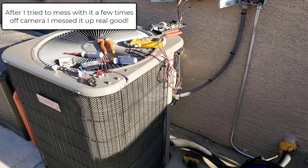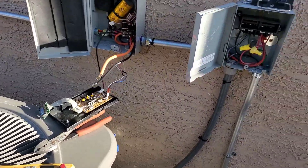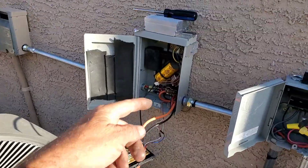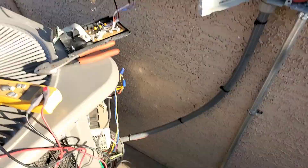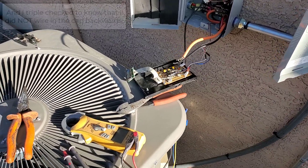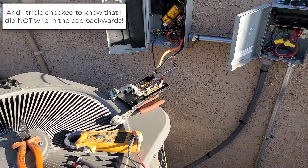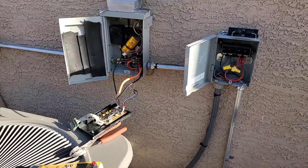I just tried to do a little modification to my homebrew AC unit here to hopefully make it a little better on the regulation. So I added another one of these capacitors - I took it off an old circuit board from an LG unit. I tied it into the DC bus at the VFD and everything was running, and then it exploded. I don't know if that was a bad capacitor or what. I couldn't find anything shorting or touching on it, but after that the whole system was shorted.